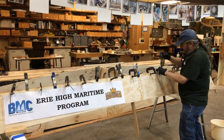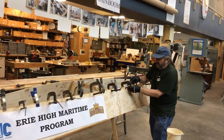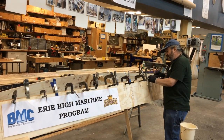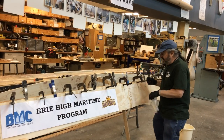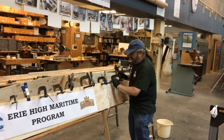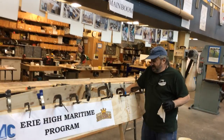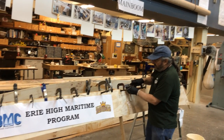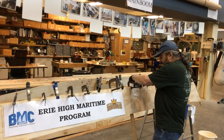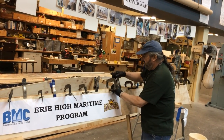I'm still just cleaning this glue off. Now, this whole bottom gets planed off to be flat to fit the plywood. So if we didn't take this off now, it'd be okay — it'd come off later. If we used epoxy, it would come off a lot harder later, so it's good to do it now. We have to get the inside under here — I'm sure it's dripping down the side of the boat, and we'll do that next. We'll roll this boat right side up where we can see in there and clean it some more on the other side. The cleanup's important. And as you can see, we're halfway done already with this one. Not too bad.